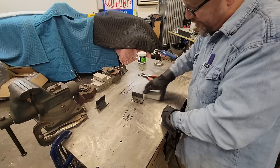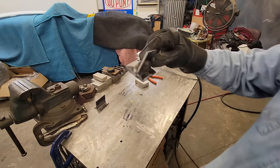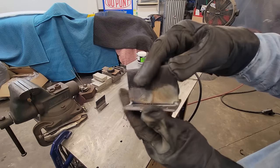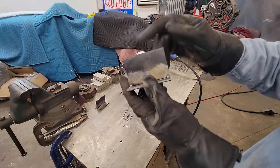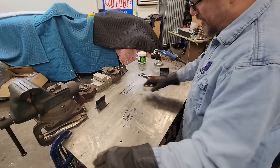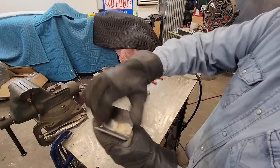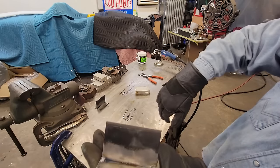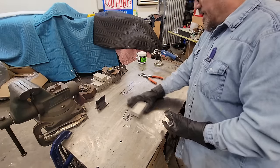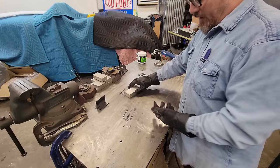All right, guys. Ready? Looks like it's eating in there pretty good, digging on down into the root. The BBs, look at that. All that stuff wipes off. Look at that, no bunch of BBs. We can just clean it right off by hand. Looking like $1 million. I'm telling you, the anti-spatter will be your friend.